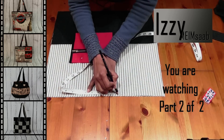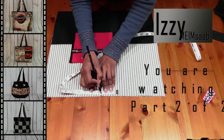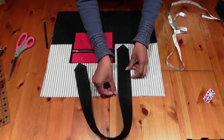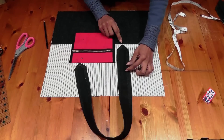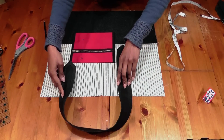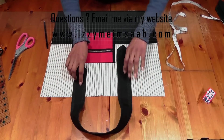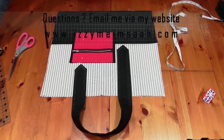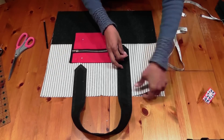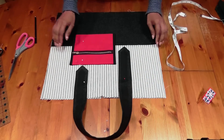There's a 5 inch mark and a 2 and a half inch mark. Starting from there to there, and 2 and a half is dead straight in the centre. We're going to place the edge of the handle on the mark like so, a little bit high like so, and then this is going to sit just about this pocket. Just see how you like it aesthetically. If this looks good then go ahead, otherwise change it a little bit, and I'm going to place a pin on the handle.